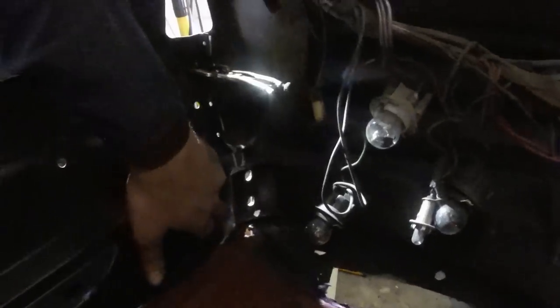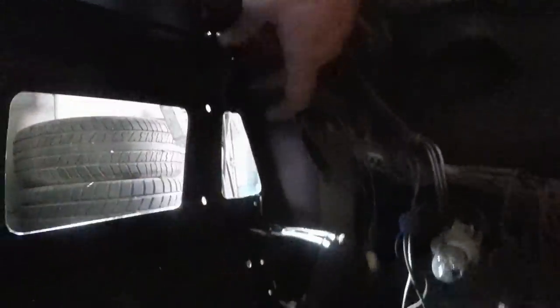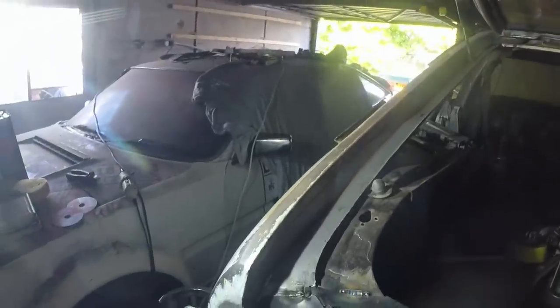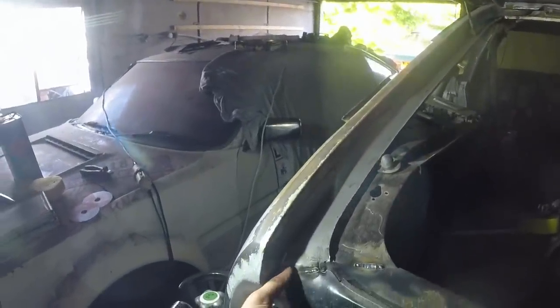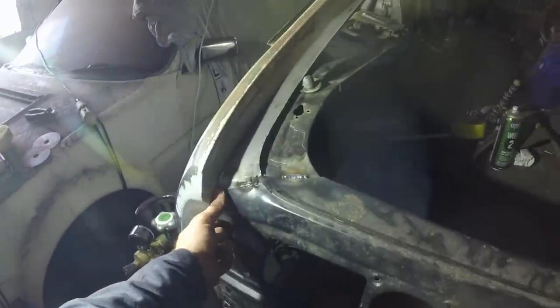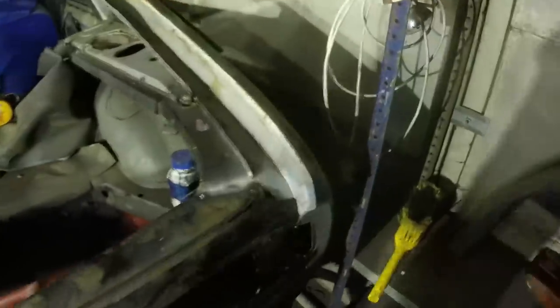In the past, I've also stitch welded between that bumper reinforcer and this. And also, because I don't know how to braze, I seam weld that bit, but from the backside. So that's all fully watertight. In fact, I might be able to do it from this side and then grind it smooth with, now I've got a finger sander or the Dremel. Same at this side. Ouch.